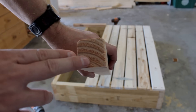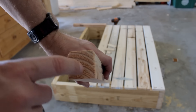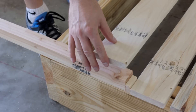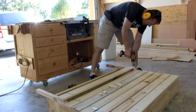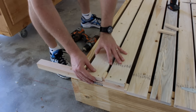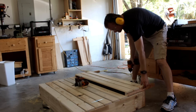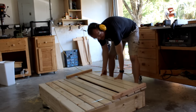Now I can just flip that over. Some strap hinges will connect those two sections. Time to assemble the final top section. I've taken some 2x4's and ripped those in half to make a couple of 2x2's — you don't have to do that, you can just buy 2x2's, but you probably won't get these rounded-over corners. I want these to be facing down when I attach the slats. I'll butt those up against my spacers, then lay out the remaining slats on top of the 2x2's. The reason I wanted the rounded-over corners facing down is so when I flip this section over and attach it to the other two, those rounded corners will be top side. Since this is a kid project with very tiny ones playing around it, I don't want a bunch of harsh edges all over the place.